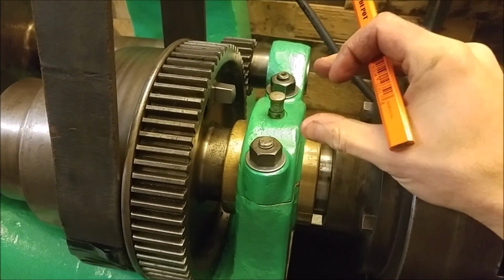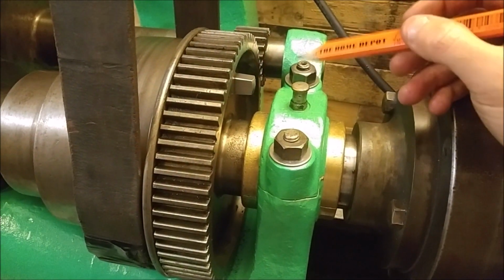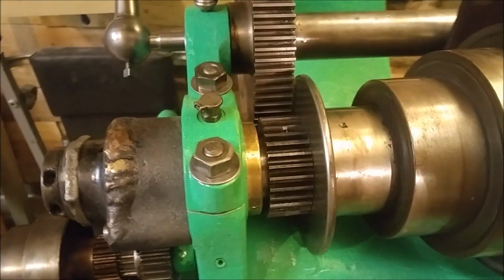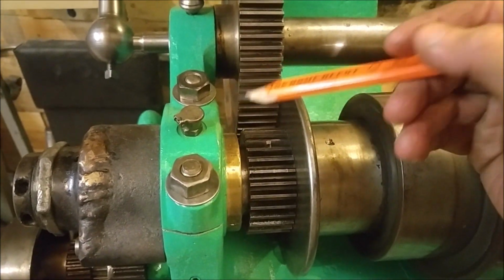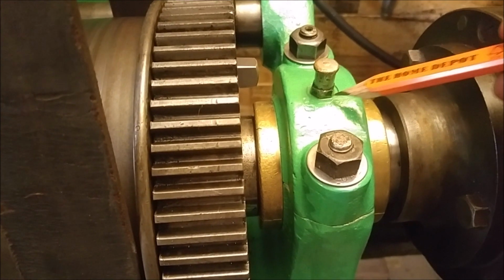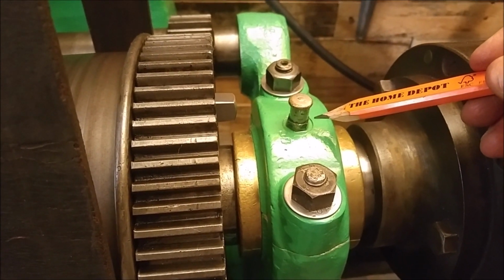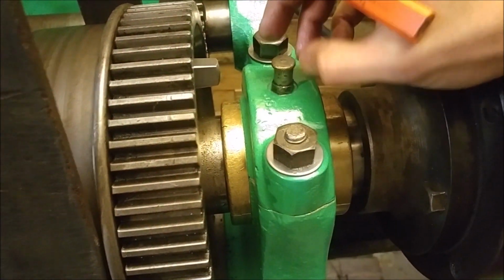I've seen some people that have the ones that are glass. I think the brass with a small cap will be fine. I don't want anything sticking out too high either on this one. So I've got two. They don't match. This one here, the threads are actually incorrect for this lathe. The threads are too small. And it looks like they're tapered almost, so it's sinking in there, and the end threads are catching, but the rest aren't. On the other hand, this one here, the threads are exact, and it's a metric size, 12 by 1.25. It's a bit of an odd size for me anyways. I think they sell them on eBay, but nothing of this kind of quality.